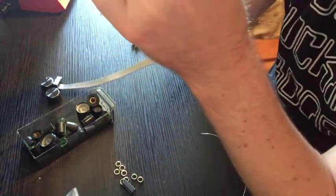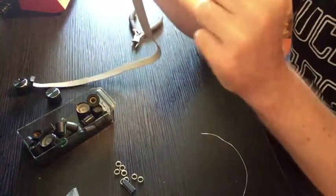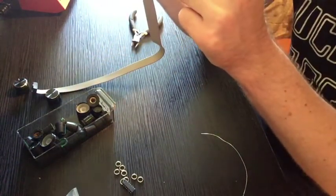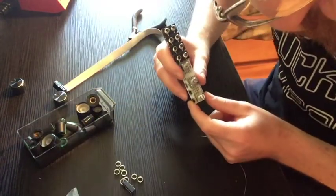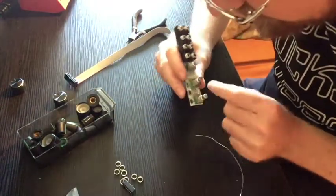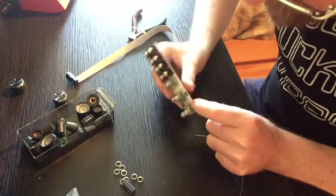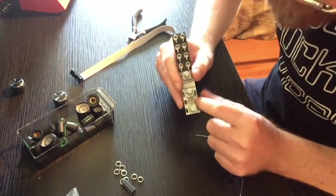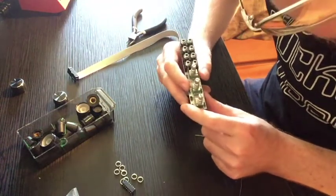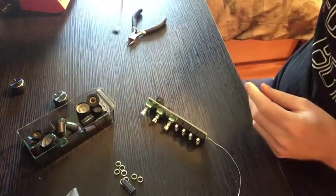You want to be sure to get good solder joints on this, because the power is really important, obviously. Although it is redundant, it's a row of 10 pins, and you only need three of them to work. The middle six are all ground, and both of these are the negative, and both of these are the positive. So if either one of those is connected, it should work, but still, take care on that part.